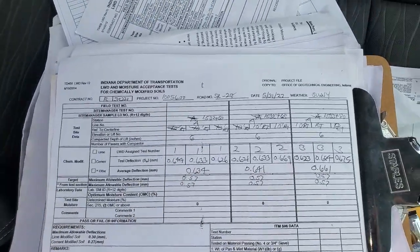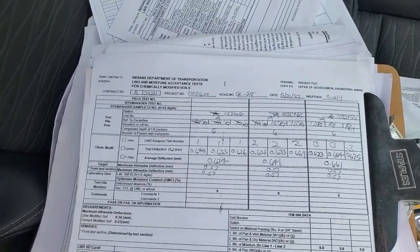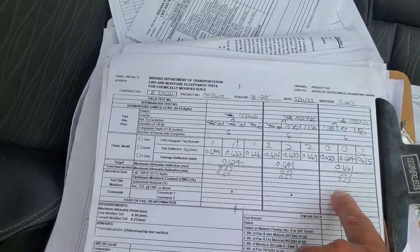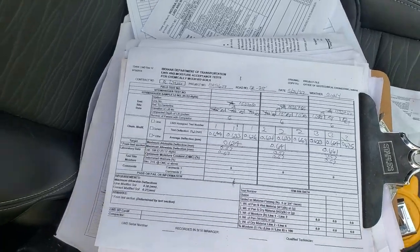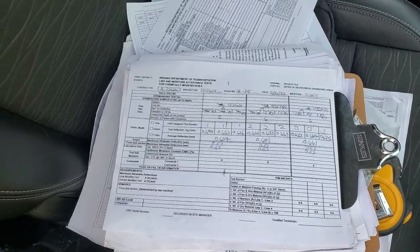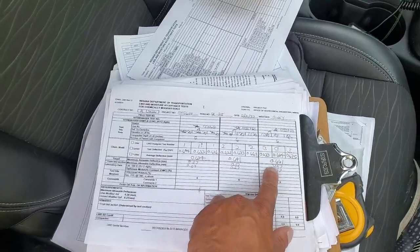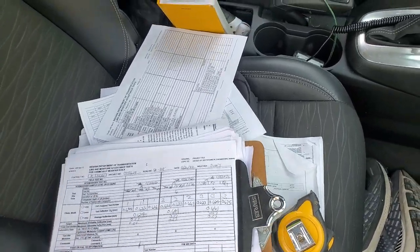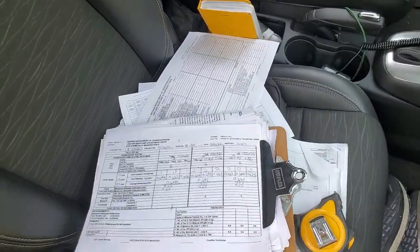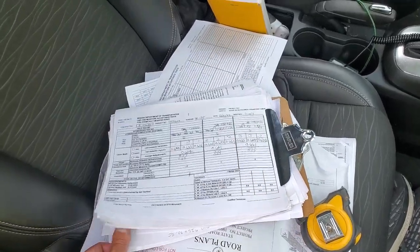Now, based on my own judgment, when the soil was tested, numerically, it did not meet the requirements. So when it doesn't meet the requirements, what is my recommendation? Well, they're going to have to roll it again and add more water and roll it again. Now, if it's just above the requirement, I'll let it go, and I'll say, well, looking at the soil itself, it's not going to go anywhere.